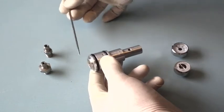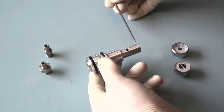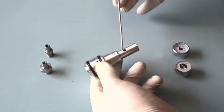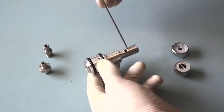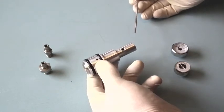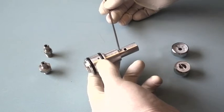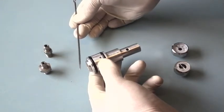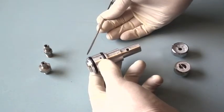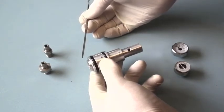Also, the vastly increased pressure on the piston while the pressure on the other side is low would cause the knife edge face to embed itself into the sealing face on the adjuster screw and damage the regulator. If the pressure here and on the piston side both reach 200 bar, you won't damage the seal face on the adjuster screw — but only if this chamber at the front, the outlet valve chamber, doesn't go well above the regulator pressure.